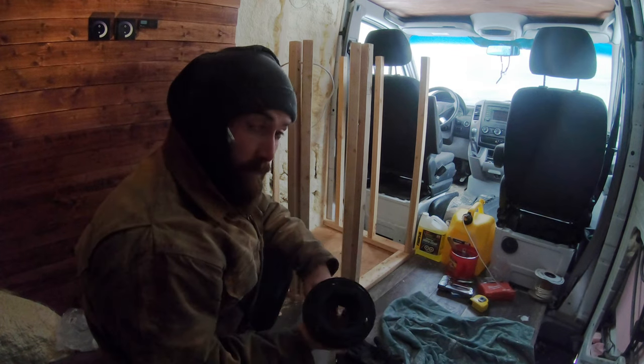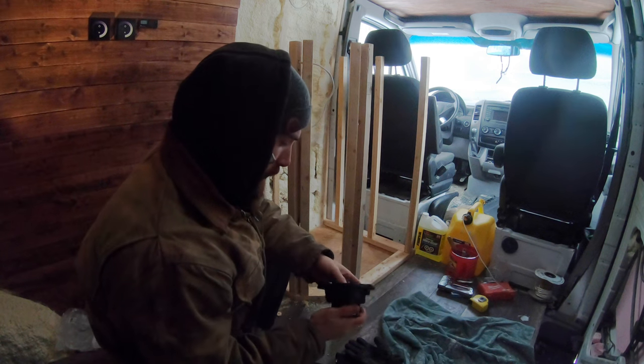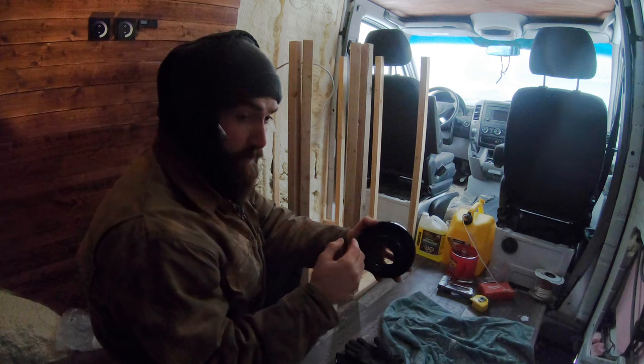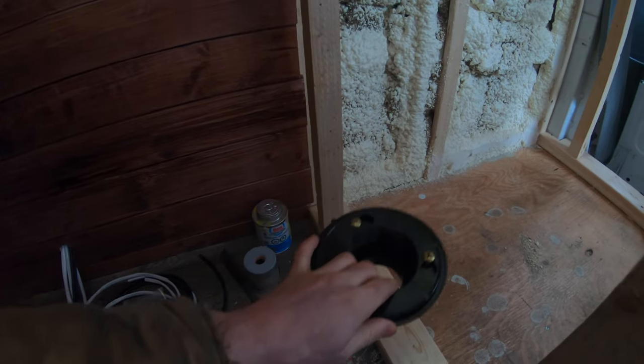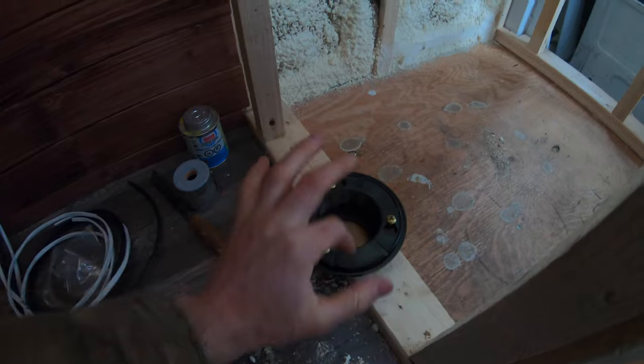Let's get started. This is the drain I'm using. It's for tile. They give you a 2x1.5 bushing. Stick it in there, obviously with glue. I'm just gonna drill a hole large enough for 1.5 inch pipe, maybe a 2 inch. My plywood will be carved out from there, so that'll sit in the holes, and then the membrane will come into it, cut a hole in it.